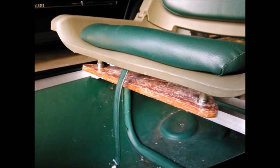The bars are laying on angle aluminum brackets that are bolted into the gunnels. Those angle brackets should probably be a little bit deeper, but you want to keep them high enough on the gunnel for support on the steel. I would get bigger angle brackets — bigger meaning deeper — maybe come down an inch, because the main reason is your high center of gravity.